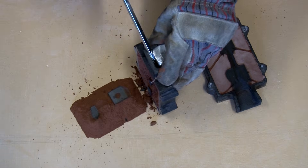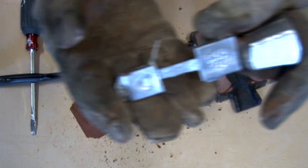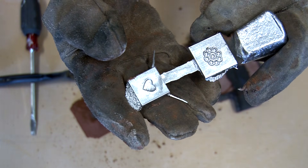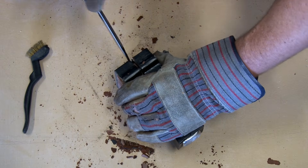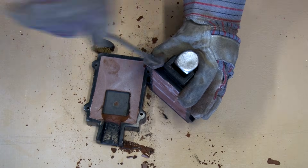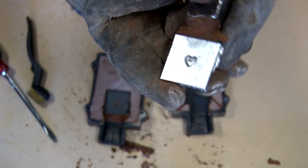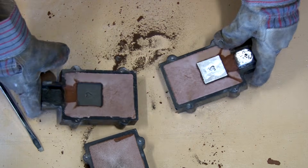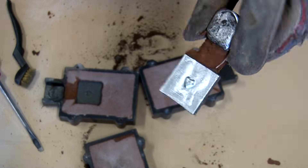It really got stuck in there this time — I had to go get a screwdriver to pry it out. I tried to do a second heart but it actually got deformed; there's some shrinkage in the metal, so basically the top die is the one I'm going to salvage from this pour. That one turned out pretty good — that's the Innie — but you can see a little indentation where that powder was that I pointed out earlier. And here's the Outie, and that one looks pretty good with no problems.